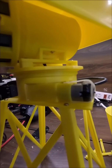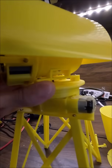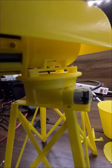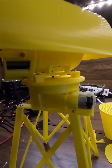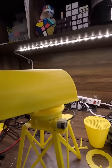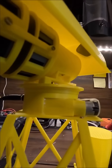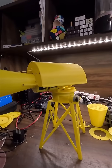One of the biggest changes that I've gone through on this is the rotator. This thing rotates incredibly smoothly — this is great. If you've printed this siren yourself and you're having rotator problems, I highly recommend reprinting this part, because it's had some problems in the past holding weight. What I think is cool is that with the new design, you literally don't have to worry about adding weights to the back of the shroud. I still have mine, but I could totally take those off and this thing would work just fine without them.